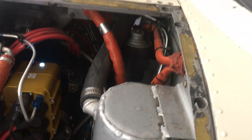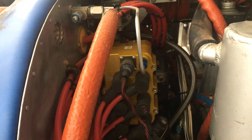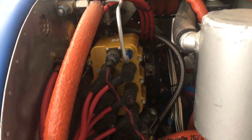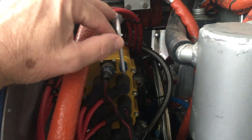That's it for the timing. The last step is to shut off the power to the magnetos, and then re-put the cap that covers the push button back on. I use just a little bit of red RTV to make sure they don't backslide out of the hole or get contaminated, or prevent someone from accidentally pushing it.